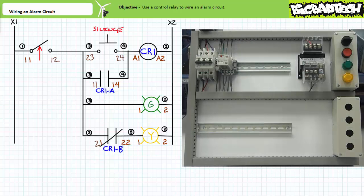Before the circuit is placed into service, make sure the selector switch is switched such that the normally closed contact is being held open. Recall the simulated float switch is normally closed; however, it's being activated into its opposite open state by being triggered by a full tank — that's what the red arrow on the ladder logic diagram indicates. When the system is unlocked, plugged in, and the circuit breaker closed, the alarm circuit does a whole lot of nothing. That's the point: the simulated float switch detects a sufficient quantity of fluid in the tank and doesn't feel compelled to bring it to an operator's attention. The three-position selector switch is in a position that activates the normally closed contact into the open state — this is the tank full condition.